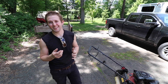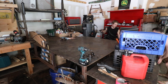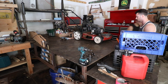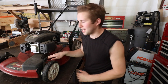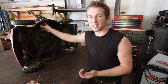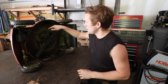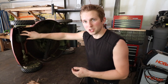Not sure if it's within the linkage or the gears, but let's take it apart and see if we can figure out the problem. This drive linkage follows the deck of the mower and goes into this plastic housing here. I'm going to need to take that cover off. There are a couple bolts under the deck which are kind of annoying because grass gets under here and corrodes everything slightly — kind of a bad design. Basically there's a belt driven off the blade spindle that goes to this little gearbox right here.